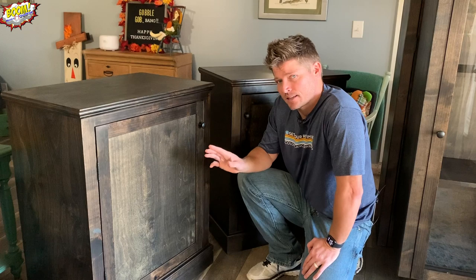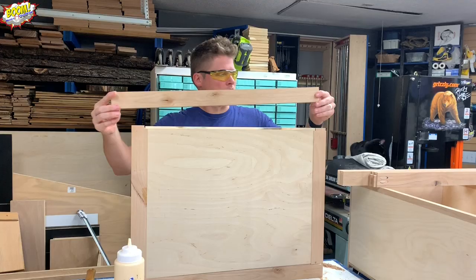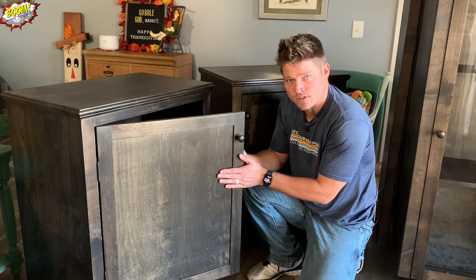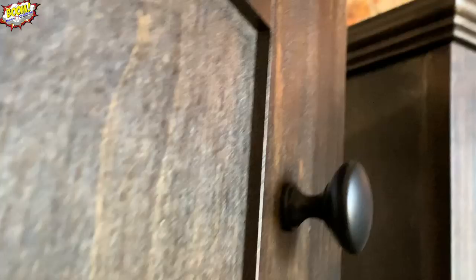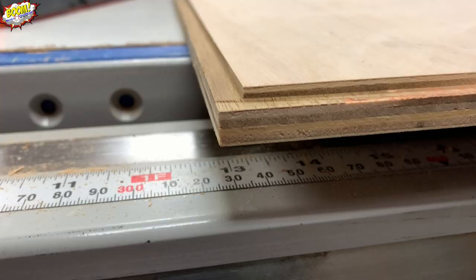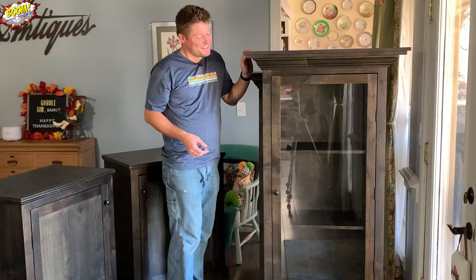The door frame is a little different — I did not make it like the face frames for the cabinet because I didn't want pocket holes to be seen. So it is put together with tongue and groove joinery, and the groove is continuous all the way around the door to make room for the half-inch thick panel. I offset the center of that groove just a little bit because I wanted slightly more reveal on the front versus the back, and I wrapped it all the way around the center panel just slightly inside that groove to give me the appropriate reveal I wanted.